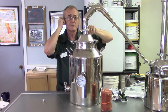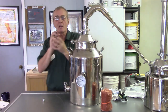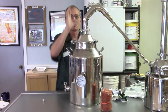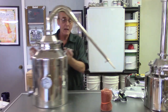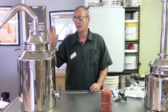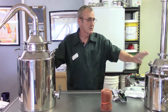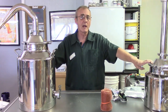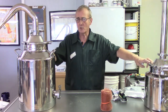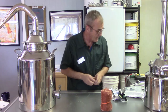You roll up copper mesh — I always put two rolls in, equivalent to about two plates — slide them up the column, and they slide right back out easily as long as you don't pack them in too tight. There's no place for raschig rings or marbles; just use copper, and it runs extremely well. We ran a honey wash in this eight-gallon model using a 2000-watt heating element with a controller, and it took about three hours. The Mighty Mini with about three gallons ran just shy of two and a half to three hours total. This eight-gallon still runs about five hours from start to finish.